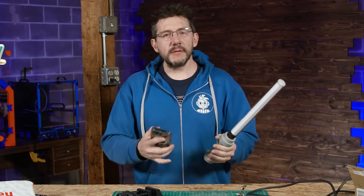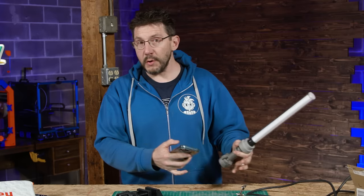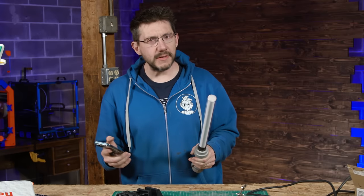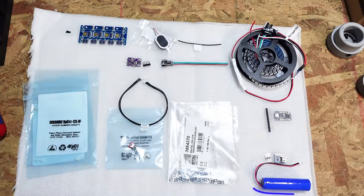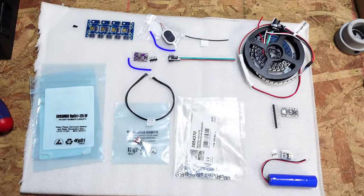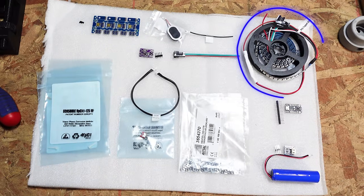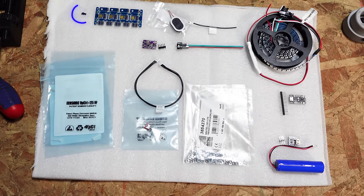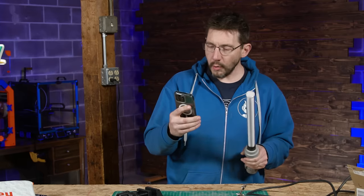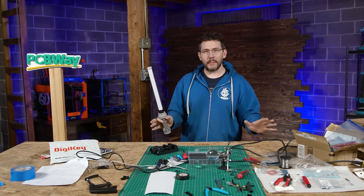So now it was time to solder up the electrical parts, and I got these from Adafruit, from DigiKey, and from Amazon. The list is a Trinket M0, a LiPo battery and backpack, a speaker, amplifier, SOT23 carrier, a NeoPixel strip, a simple little switch, some Pico Blade cables, an FET transistor, a 330 ohm resistor, and an acrylic tube. So many tiny little parts.